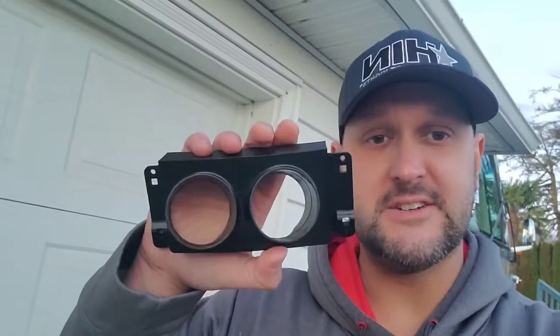I also want to touch base on my last video. As you can see, the gauge mount — we got it here. She's all painted up, looking really good. To be honest though, I screwed up. After I shot the video, I let it dry a little too long before I went to put the next coat on, and it did not adhere or take well because it was smooth. So I ran into some issues and had to sand everything back down and repeat the process.